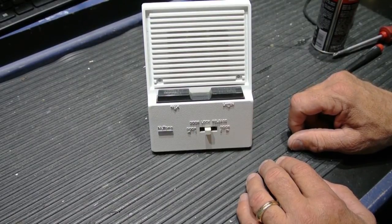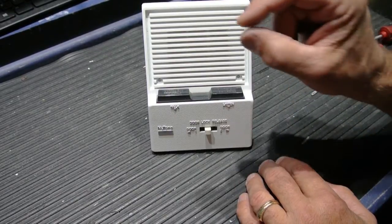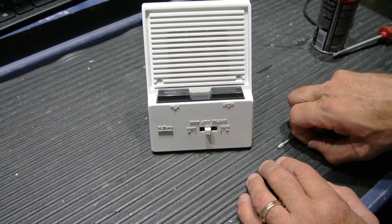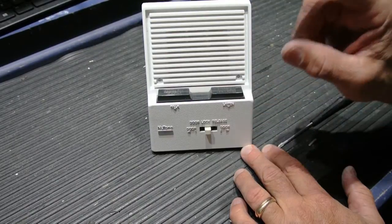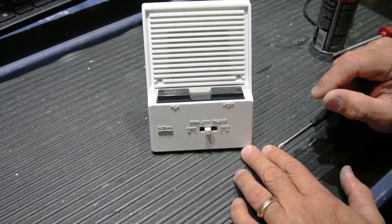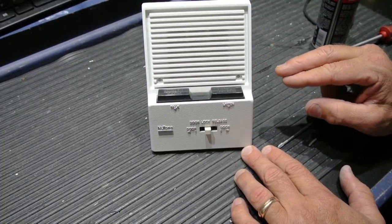So how does the relay know when to energize and flip the conversation from incoming to outgoing? Well, if you recall earlier when we were looking at the circuit board, there were the little blue resistors on the board. And a 478 system is actually a good design. It's very simple. By moving the switch, you're making a connection with the switch, but you're also putting the little blue resistor in line in the circuit, and the amplifier sees the added resistance in the circuit, and that tells it to flip the relay to the on position, which will flip the direction of the conversation.